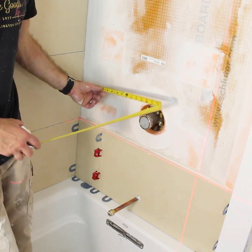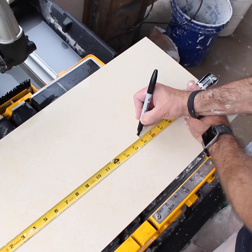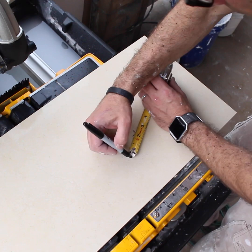These tips will help you tile a shower plumbing wall. Add your spacer below your shower valve to get an accurate measurement for the center, and then mark the center on the tile that you're going to be cutting. Then this is important: denote the radius around the center mark. For example, if the hole is 4.5 inches, your radius is 2.25 inches.